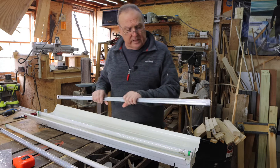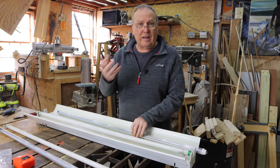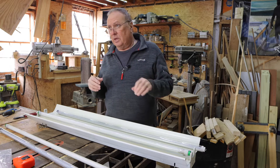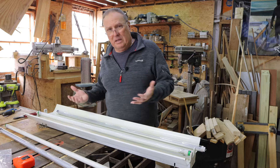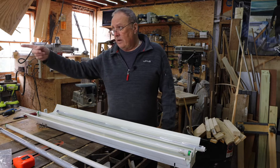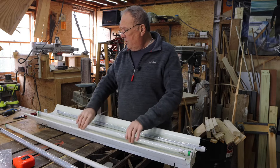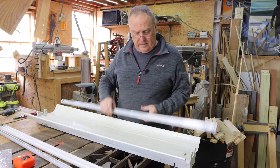Another advantage those LED lights will give me: fluorescent lights are affected by temperature. It's a gas, so they don't always work well when it's cold — they start flickering until they reach an operating temperature they like, then they even out. That's a pain. This shop isn't heated, so when I come up in the morning I want to flip the switch and see what I'm doing, but I can't until those things stop flickering.